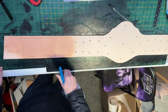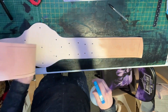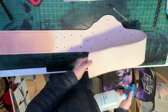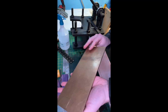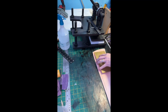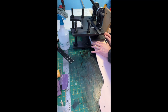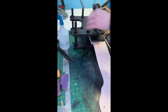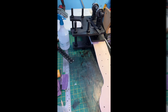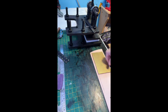The male and female ends of the leather are then cased with water in preparation for the press plates to make the tooling impressions on the face of the leather. The press plates are made of 5mm CNC brass, and the machine used is a clicker press. I place the plate down on the wet leather and insert them under the press. A handle is then lowered which applies 2 tons of pressure — you have to get this right first time or you mess up your whole project. Here you see the end result of the press.